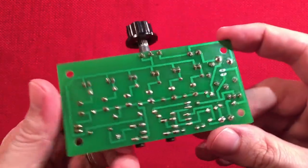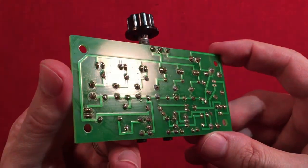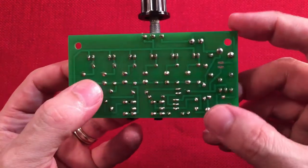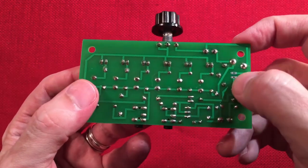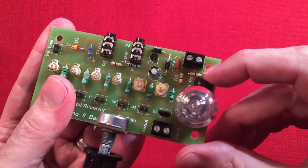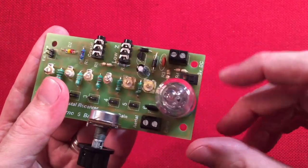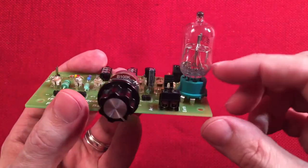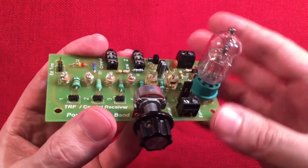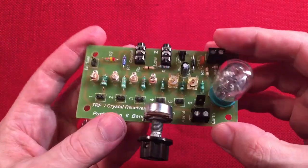For aerial and earth connections, I used a 40-foot aerial and a ground to my water pipe to get some signals. On the back of the board you can see I tried to clean it up as best I could — very clean. It was very easy to solder; the solder flowed very smoothly. My LED is left off because I'm thinking about changing the color — I talked about this R4 resistor. I'm going to change that out for a different value and do maybe a blue or violet, something cool underneath there instead of an amber one.